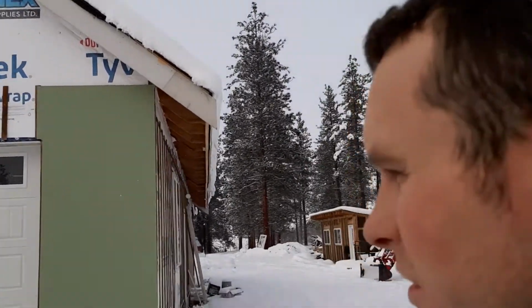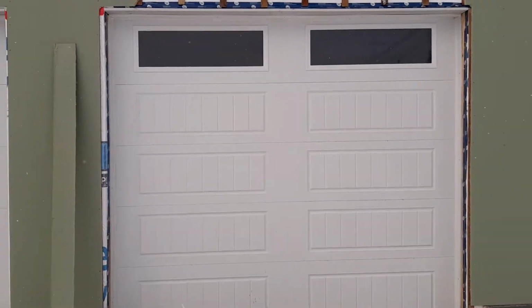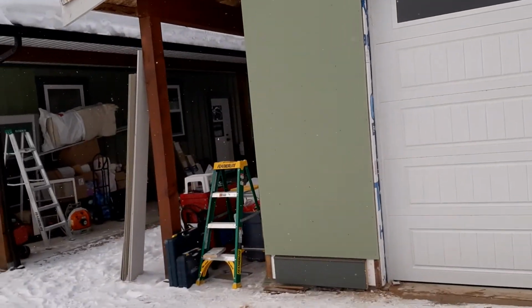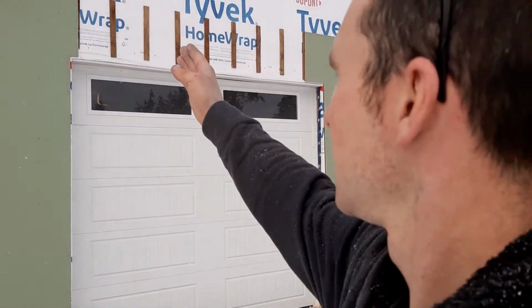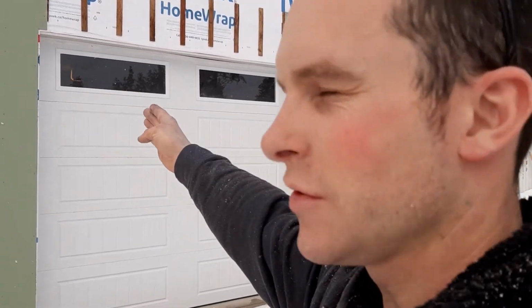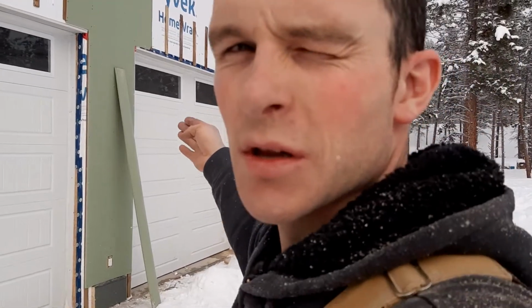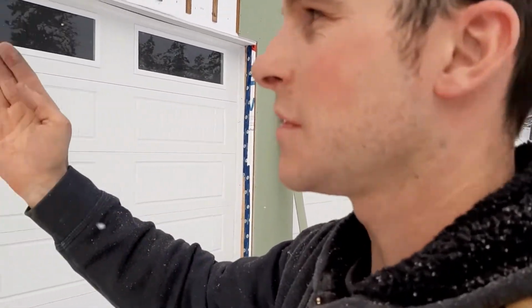3 pieces installed. These 3 front pieces, as you obviously saw. It went fairly straightforward, no surprises really. The only thing I had to do was move the battens on the ends. I had measured in from the edge of the wall 12 inches, but I decided to go from the middle and have 1 batten in the middle, and then have them all evenly spaced out.